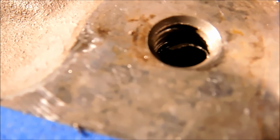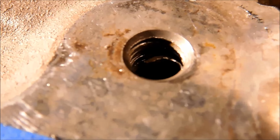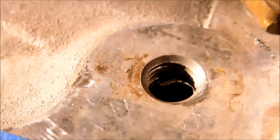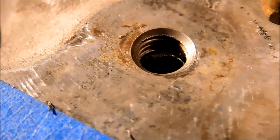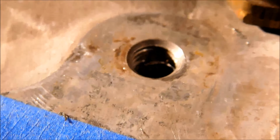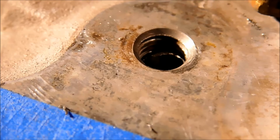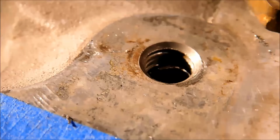Now I'm going to spin this in a counterclockwise rotation, staying right over the center of the hole, and hopefully we can close up that loose helix that's still engaged in the head itself, and it'll walk out. You'd be surprised how much waste matter there's going to be coming out of this hole. I bet it's about 3 or 4 inches of actual string, so try not to break it, and let's see what happens. A little penetrating oil would not be a bad thing at this point.